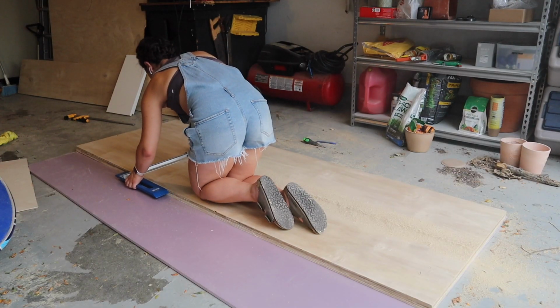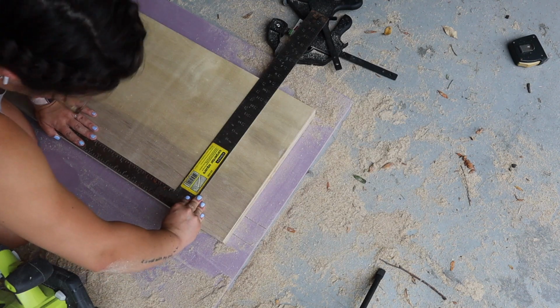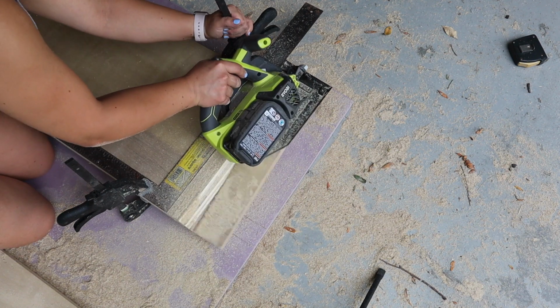After the glue had dried, I could finally cut the double layer of plywood in half. Being careful to match the angles and the wood grains I wanted to run together on the top side of the table, I cut my 45-degree angles on the top and one side of the legs.